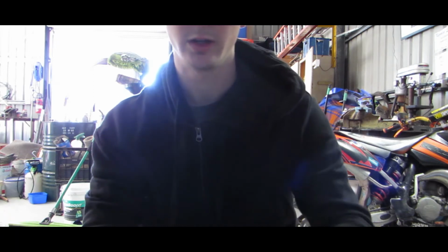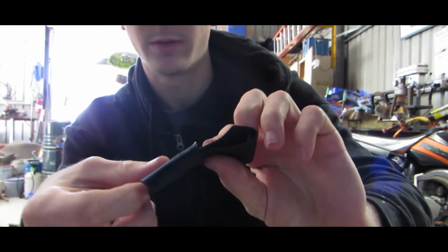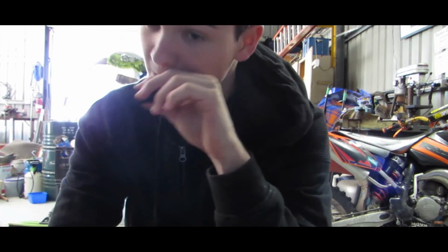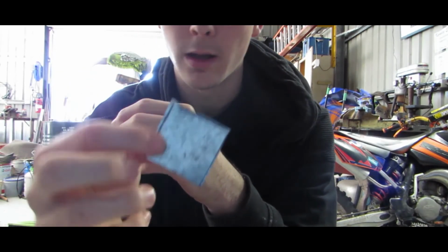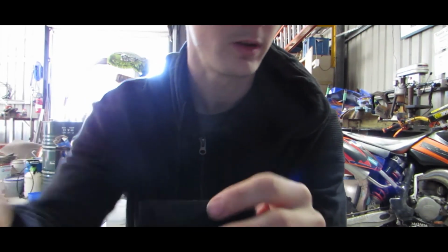So what you're going to want to do so that you can rivet these onto the shield is you put the buckle in between here. I've cut this a little bit, and to rivet it on you need a piece of metal that you can actually put the rivet through. It won't just stick through the strap. So I'm going to cut out 4 of these. I've got one now. Grind them down, make sure they're not sharp, and then that will be riveting.